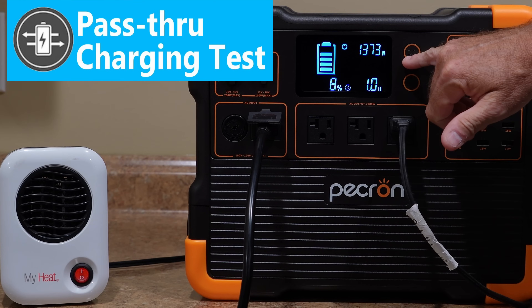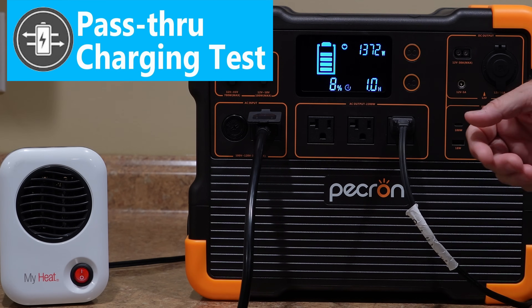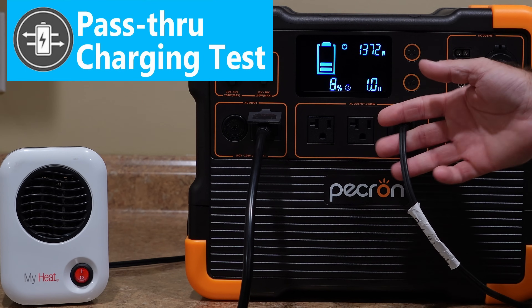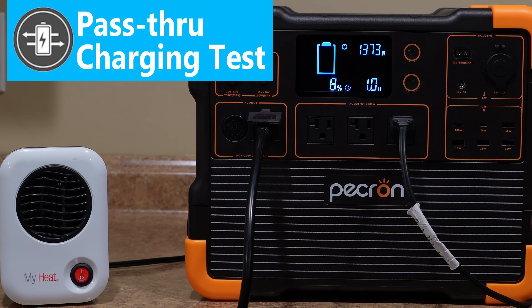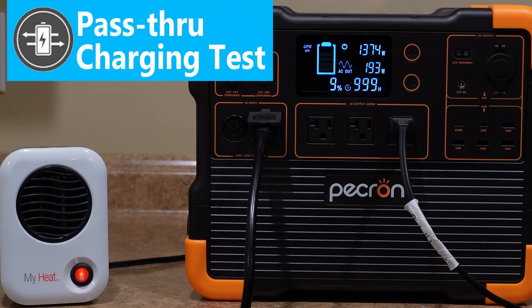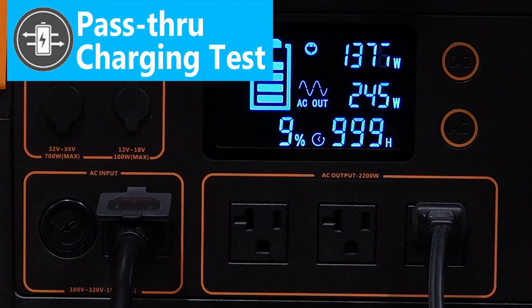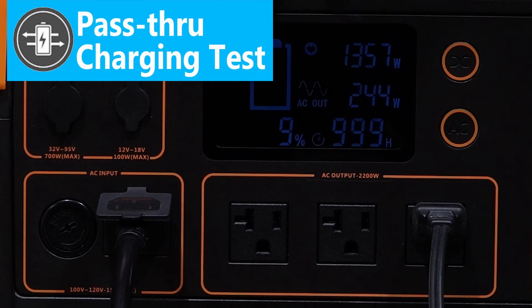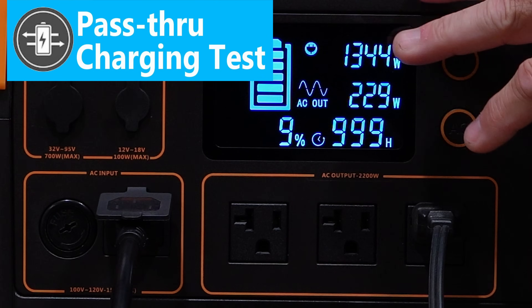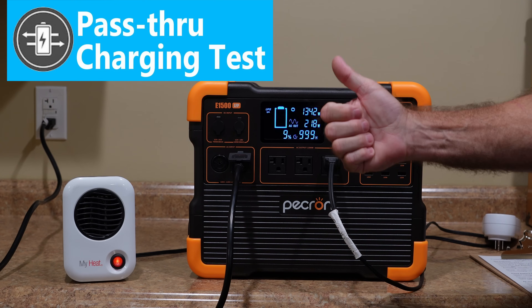As we're putting in from the grid power — 1,372 watts — I do have my little 200-watt heater here that'll pull around 275 watts initially when I turn it on. Let's see what happens. This should be a complete gimme since this supposedly has UPS mode on it, so I am able to run an AC load while charging the battery. The UPS icon has illuminated — so it is passing through power. It has to do that in order to be a UPS. Pass-through charging is confirmed.